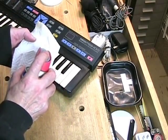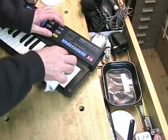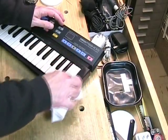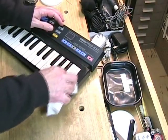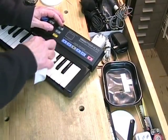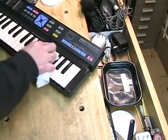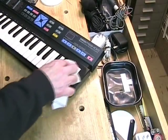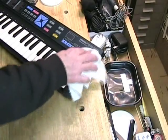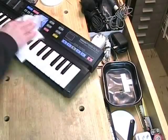What you do is spray some WD-40 on a paper towel and then start rubbing gently on the keys and on the case, and just let it soak in. You don't have to use a lot of it. You've got to do every one of the keys, rubbing them very nicely — get inside, get underneath, and do the top surface. It will not harm the plastic at all.